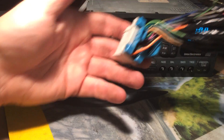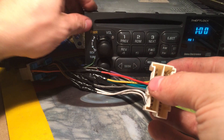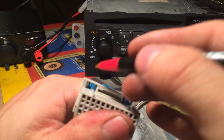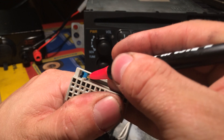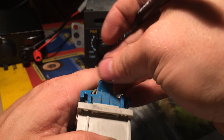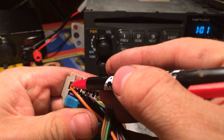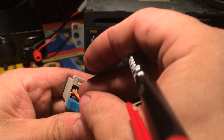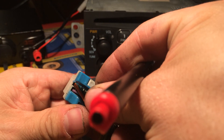And that's all there is to it - to making an adapter. This adapter lets you use the older style GM plug, at least for me, to the newer style RDS. Just to recap: you need to switch around two wires. This green wire here is originally in this slot on most plugs - just gently pull the wire out of there, then you slide it into this slot. And voila.